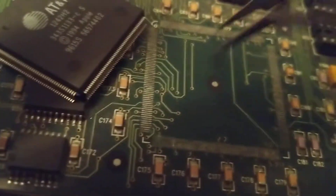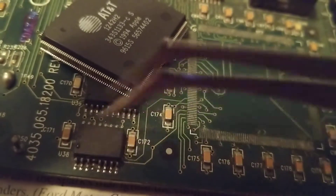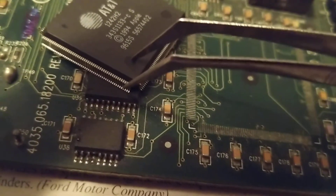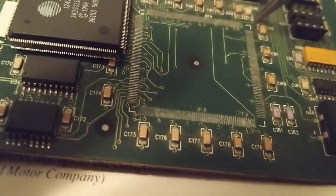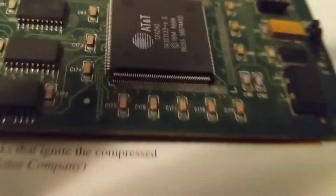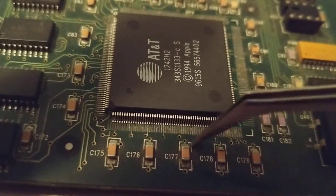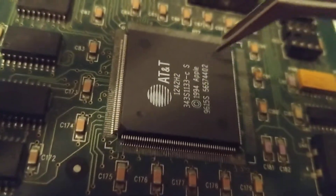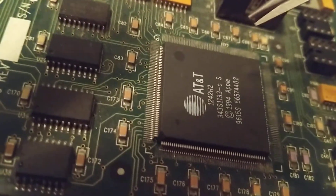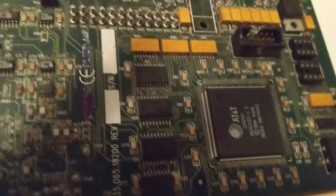There's also technology called piggyback — one chip on top of another. We take one chip here, place another chip on top of it, and those pins will have another row of pads on the outside, bigger than the first. This chip makes contact here, and there will be another chip on top of this one with 200 pins making contact with the pads outside. That's called piggyback. The reason: we want to save as much space as we can so we can shrink the board — that iPhone has to get smaller and smaller, that computer module in the vehicle has to get smaller.